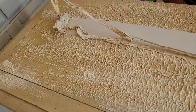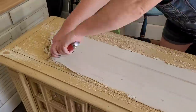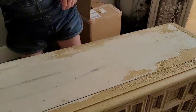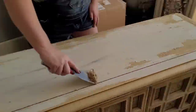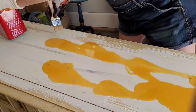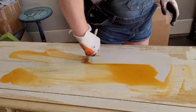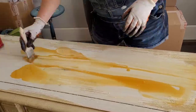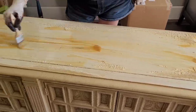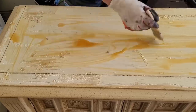I really love how this buffet turned out, but I really hated how it started — it had this really awful factory finish on it. This one was chosen as a custom finish from my inventory, so my customer got to choose her finishes. She wanted a wood stain top, which means I needed to strip the top down to bare wood. I did a test spot to determine whether to sand or use a chemical stripper, and it was so thick I needed the chemical stripper. I much prefer harsh chemical strippers over eco-friendly ones — to me eco-friendly just means ineffective. This top took two coats even with the harsher stripper. Make sure you wear gloves and work in an open space. This one is made by Jasko. With each coat I brushed on a thin layer, let it sit about 15 minutes, then came back with a scraper blade to scrape off the coating.